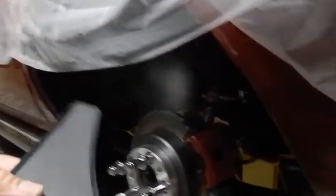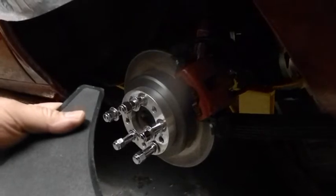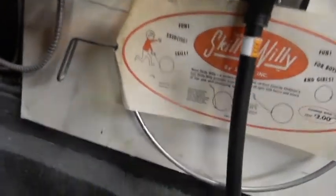We determine the height we want, put one upper screw in, leave it semi-loose, and attach something across to the other one. When you attach them like that it straightens it out, then put the other screws in. These are dated 1982; the other package is the same brand with no date — I think it's a little older.